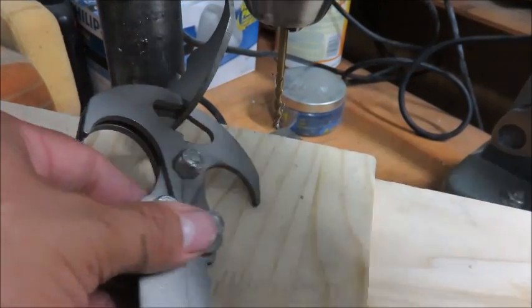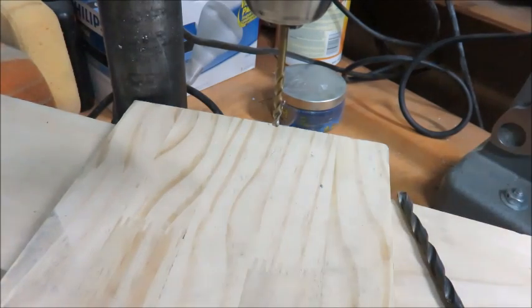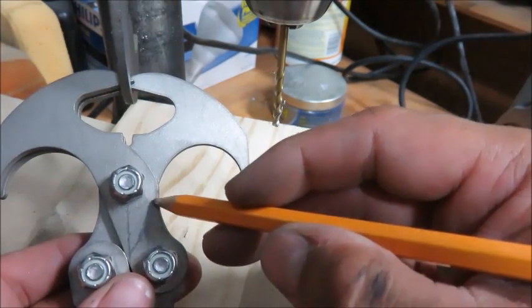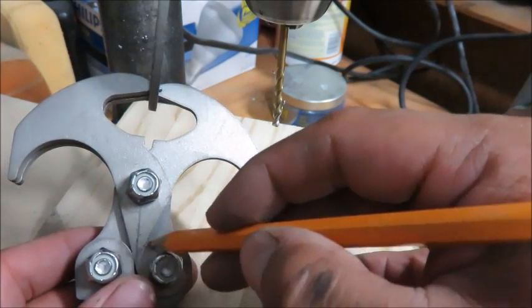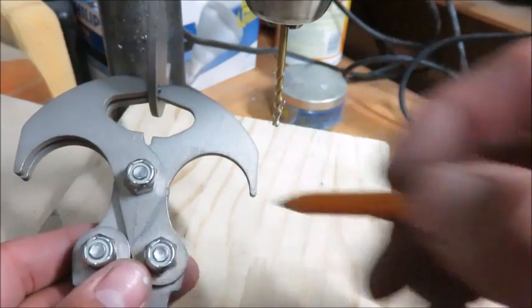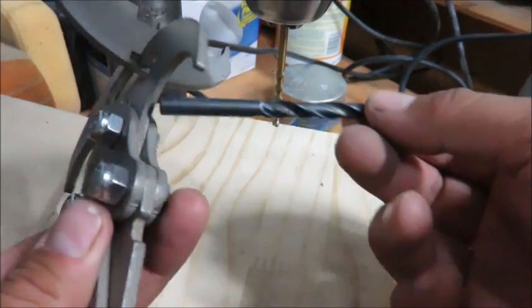This operation is best done on a drill press. If you don't have one, it's not an uncommon tool — you should be able to find somebody who does have possession of one. Before I start, I'm going to mark another line here that follows this curve right into the center point, just to help me position this hole so I don't go too far towards the edge of the hammer. If I'm using a quarter inch bit, we don't want it too far down because then it's going to poke out on the silhouette of this side.